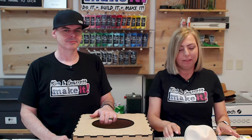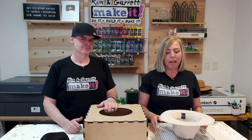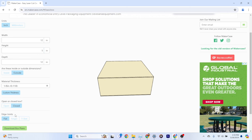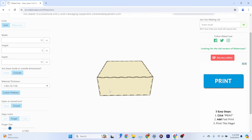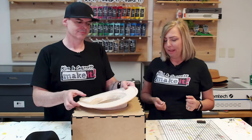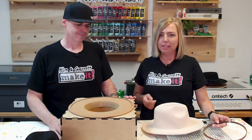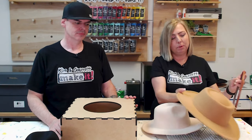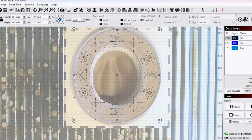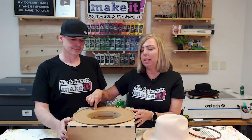Those were the tips for engraving the top of the hat. For the underside, you set the hat up in the bed like this, but it's not very sturdy. So we created a little jig using the Boxify app — we created a box with a top and a bottom. I have a jig for the top of my hat, and for my pork pie hat I can flip it over, take the brim off, and now I have the exact size for both. I lay my hat down in the jig, put it in the laser, and align the camera exactly so I know where my design will lay — and both sides end up on the same plane, not wonky from one another.